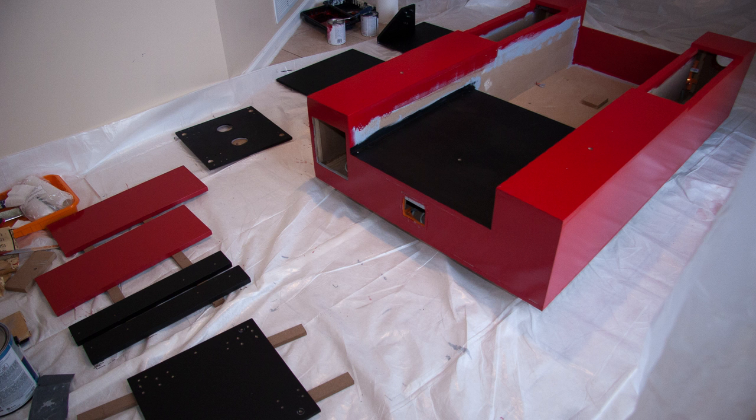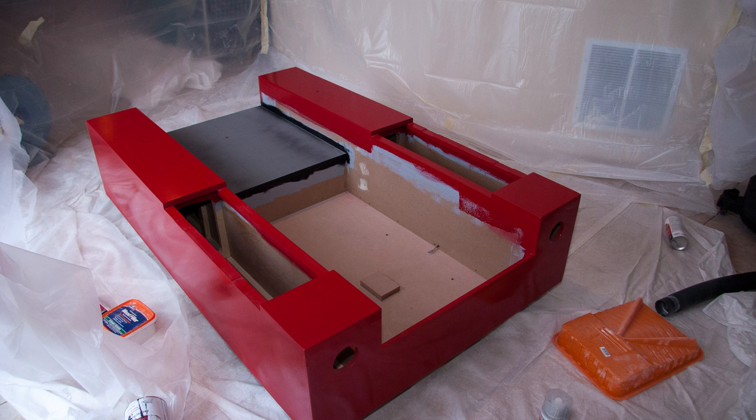At this stage you can start your paint. We use an oil-based paint mainly because it rolls on smoother, which means you'll have less of an orange peel effect — that ripply kind of finish — and also it's a tough finish. Roll on at least one or two coats, then go back over that with a 600 or 700 grit sandpaper in between those painting layers. That will help you get a nice tough and smooth finish, but bear in mind that adds a little bit of thickness, which is why we made sure those doors were shaved down a little bit earlier.